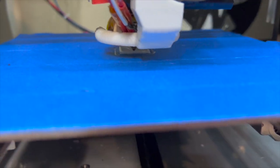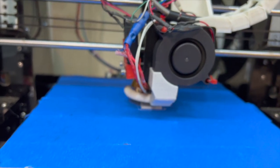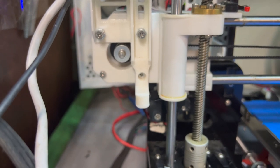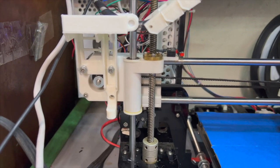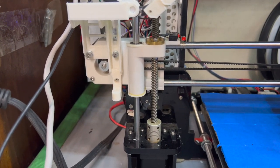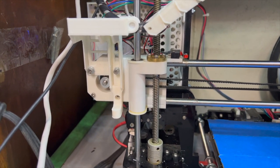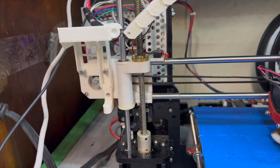But yeah, you can see it's printing pretty good. And this is just off that firmware. You can see back what I was saying with the motor. My motor goes that way. So if yours is mounted on the other side, just make sure you flip that. You can either flip your motor to this setup if you're going to just run my firmware that I have in the description, or if you're building your own firmware or you have one off the internet, if you find one. I couldn't find any, which is why I built mine. And it's going the wrong way. The easiest thing is to just flip that physically in hardware, instead of coding it out if you're using a pre-built firmware, since you can't.